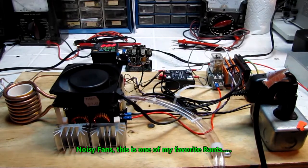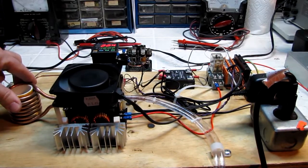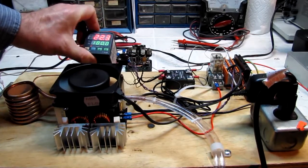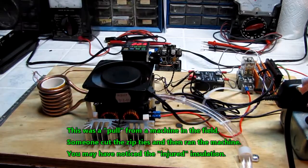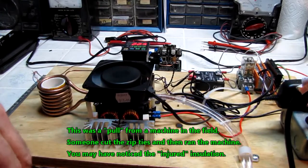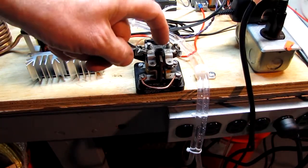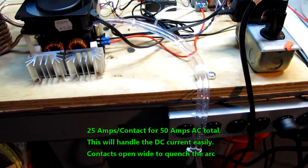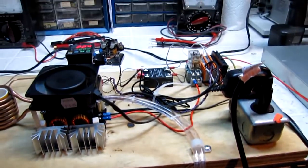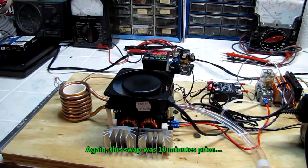So: we've talked about the pump, the amount of solder, how I insulated the cup and mounted the thermocouple. I had a bunch of thermocouples left over from having them in my travel bag for years. Originally I used a large heavy-duty relay — it had the added advantage that I could turbo boost by just pushing the contacts closed — but the armature buzzed so loudly it would drive you out of the room. So I changed over to that little DIN-rail mount unit, which is virtually silent. Now I have a little turbo boost button.